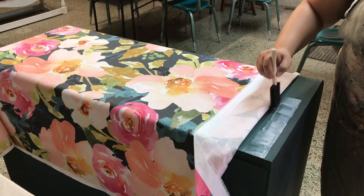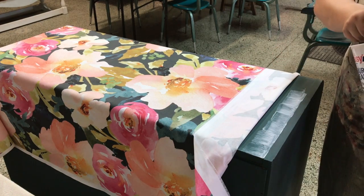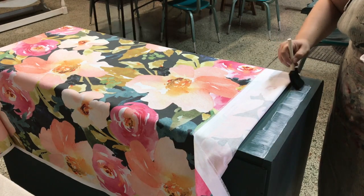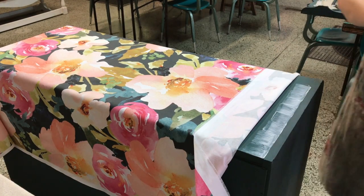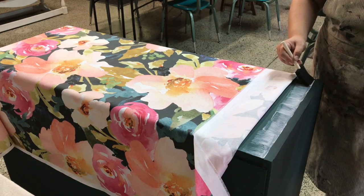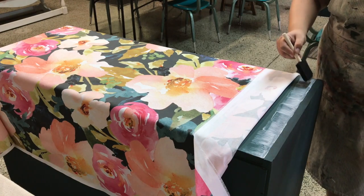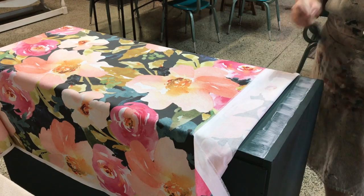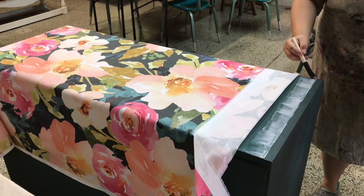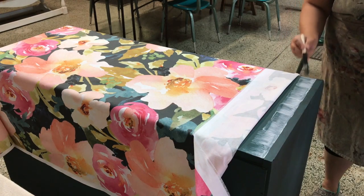Especially when it's a lighter weight cotton, you can really tend to see like a wood background through a white cotton. So you need to make sure to paint it white in that instance first. Or in this, I painted it a mix of Amsterdam green and Napoleonic blue and graphite and all this to kind of match the back of this fabric. So this is a waterfall dresser, and I'm kind of actually backwards to what you're seeing here, but